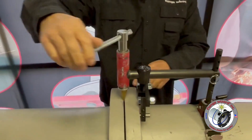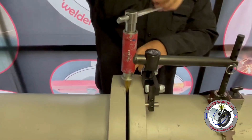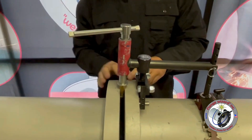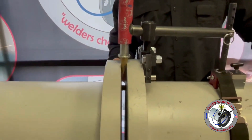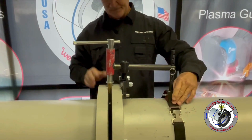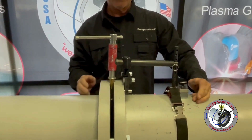Use your piston, start cranking it down, and watch as you drive this bronze aluminum wedge down in there — you can see it separating your flange for easy gasket adjustment and gasket replacement. Remember, always use your safety strap and never stick your fingers between two flanges that are under pressure.